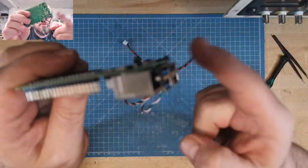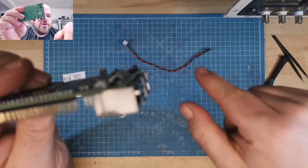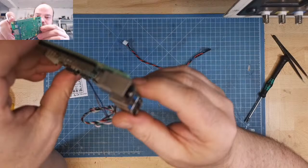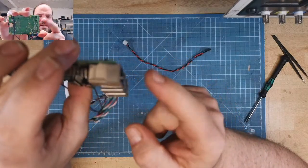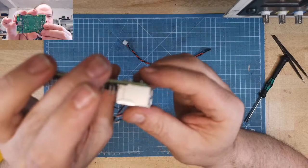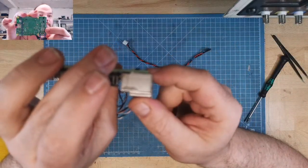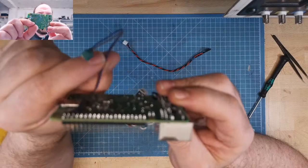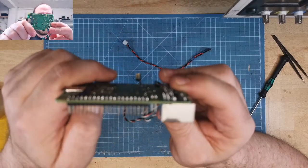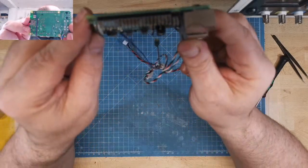These two cables are from the USB 2 ports. I want to use them internally, and I don't want to feed through cables or extend the USB 3 ports, so I just soldered this on. It doesn't harm the Pi, I just like it better. This wire is for the fan. Yeah, need some cooling, of course.